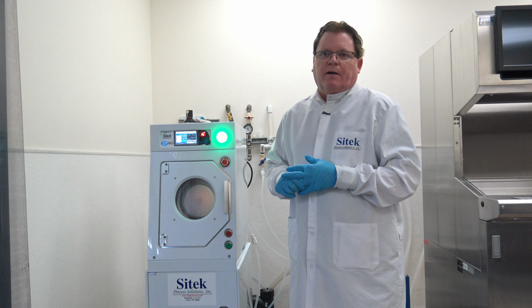We have a quality control down in dry test to make sure it passes all of the spinning and heaters, et cetera, working. Then it's brought into wet test, like the one I just showed you. At that point, we hook the DI system and N2 system up to it, and we check for leaks, valves being loose, et cetera. Once we feel that it works and there are no issues, we have another QC.